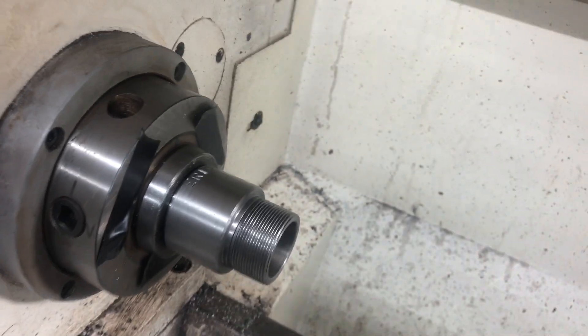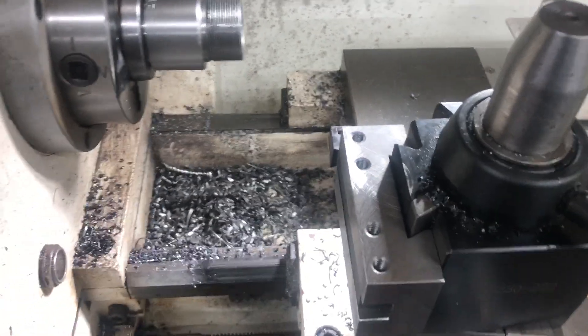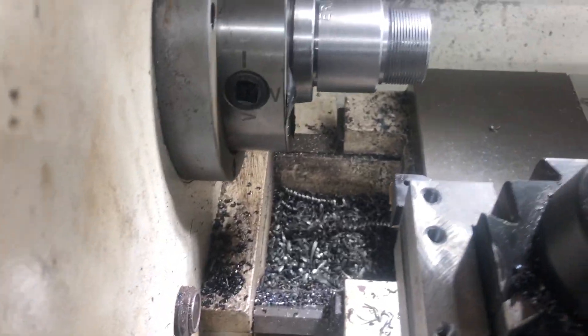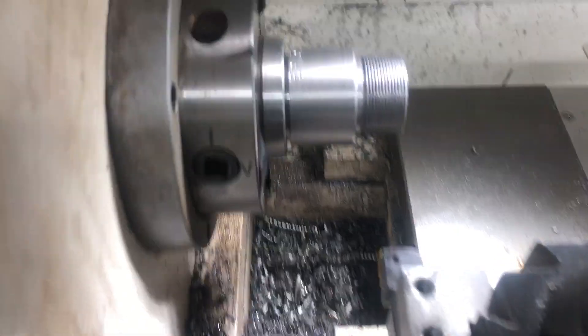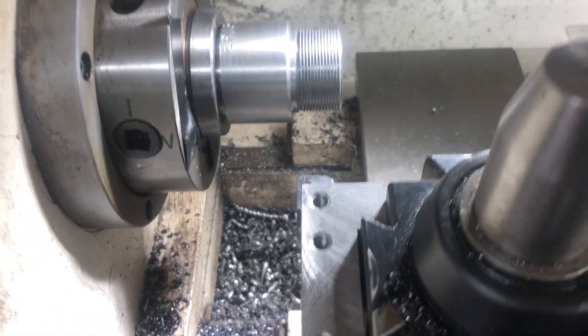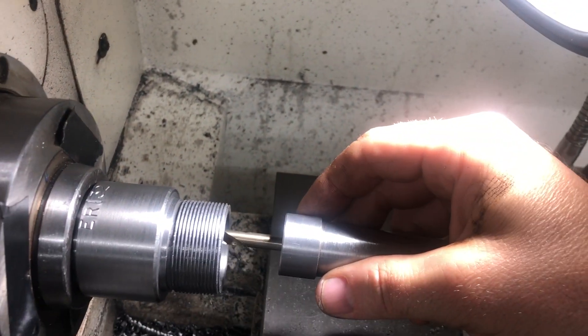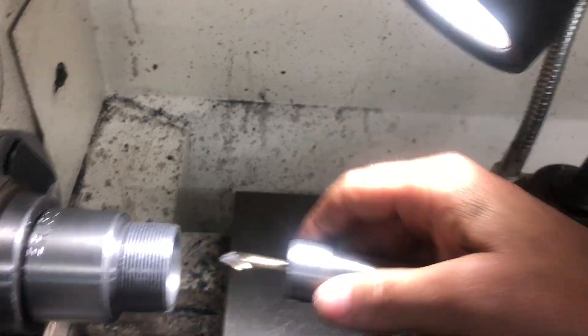The other thing to make sure of with your lathe: I have a metal guard right there with nothing behind it, so I could cut it out and get closer, but I can't machine up to my nose without a long tool. Also, because it stops way out there, when I use this I can barely center drill — I get to right about there with the tailstock because it bumps up against that. So just make sure that's a possibility on your lathe.